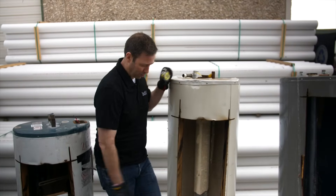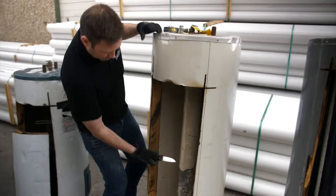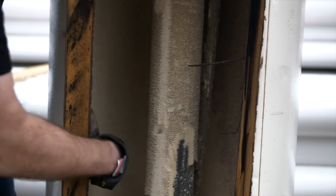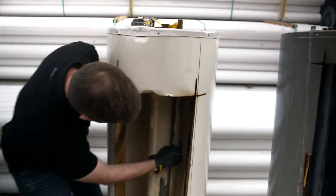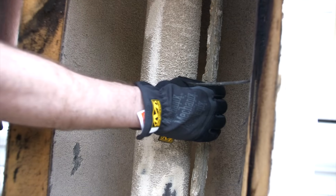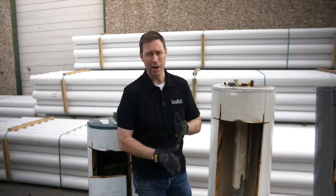As far as I could tell looking at the manufacturer specs, none of them showed insulation value or thickness, and it's not like you can cut your water heater open at the store before you buy it. Now this 2016 tank — two years old — had some scale on the walls and on the flue as you can see right here. I wanted to show you how thick it was. I think if we were to de-scale this once a year, really flush it down, and check out the anode rod — still kicking although pretty corroded — replace that anode rod maybe every five to seven years and flush that tank once a year, I think you're gonna get a lot more life than the standard 15 years.